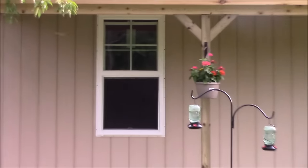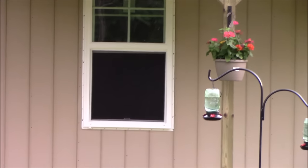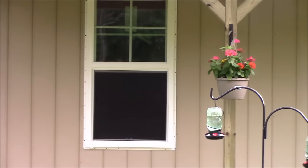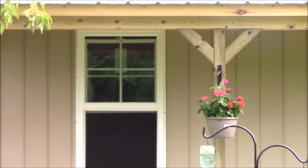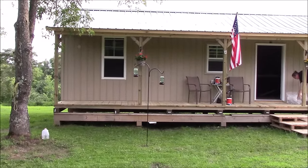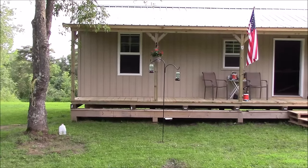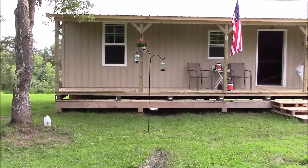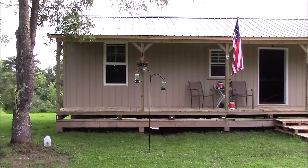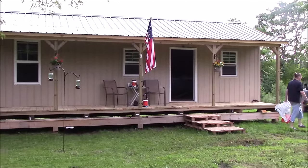But I love how straight it is with the line. I mean, as long as your jack studs and your studs are plumb and your bottom plate is level, you can just set that window in there, push it in, and screw it, and you go on to the next one. So it's the prep work that's important. Now, if those studs weren't plumb, if that bottom plate wasn't level, we would spend an hour jacking with that thing trying to make it look right. And so as long as you take your time getting all the framework prepared, they'll go right into place. I was a little worried about being the exact size, but I knew I was plumb and I knew it was level, so it wasn't an issue.